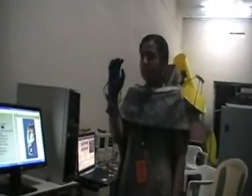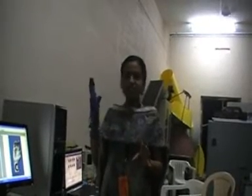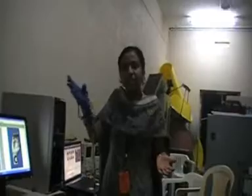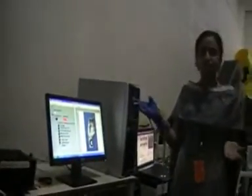In addition to the voltage inputs from the flex resistors, there is also a set of 3 inputs from the accelerometer attached to the top of the glove. An accelerometer is attached in order to detect the spatial position of the glove. The accelerometer becomes handy, for example, if there is a sign that needs to be shown vertical and if the user shows it in a horizontal position — that needs to be detected as wrong.